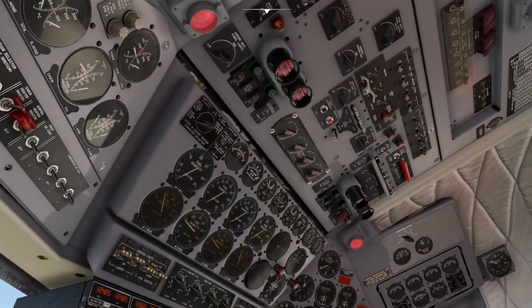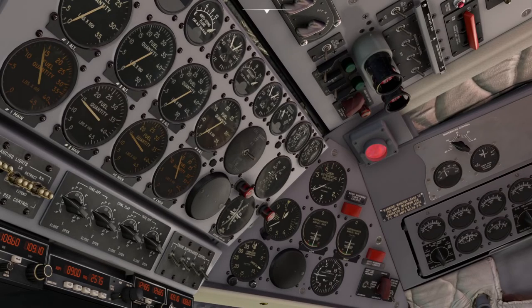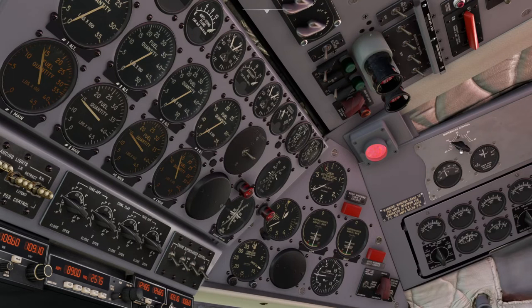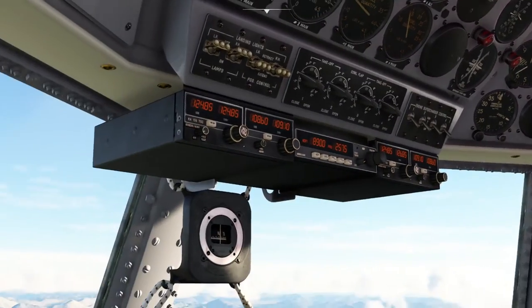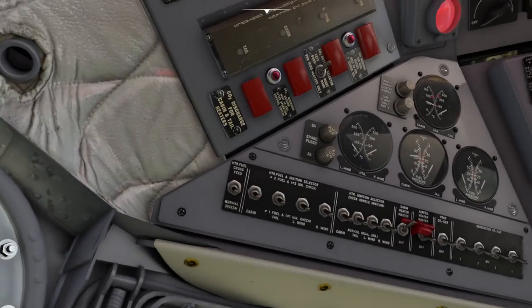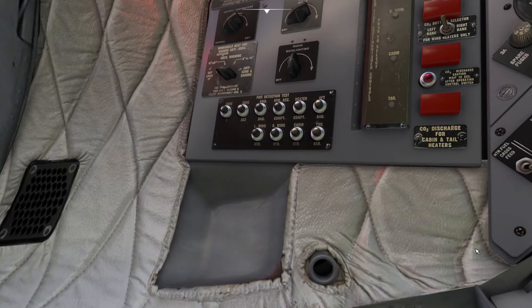Our cabin is recovered. We now have a 600-something cabin altitude and 4 psi differential — the cabin is no longer depressurized. We turned the temperature up to 70 degrees, we're passing the comfort target and we're at 70 degrees, so the passengers are nice and warm back there. Let's talk about a few other systems here.